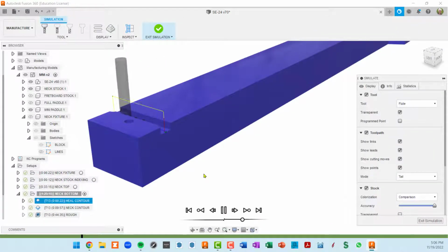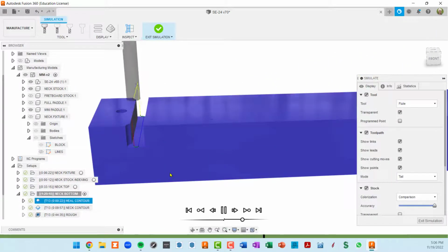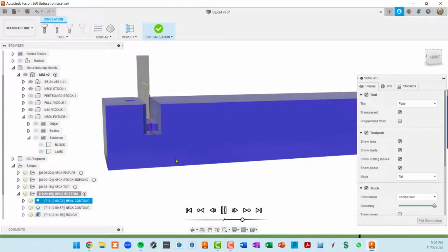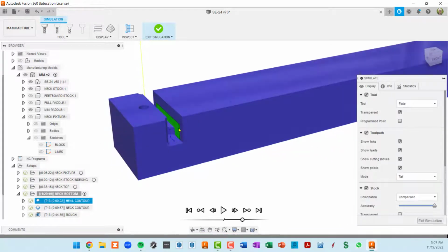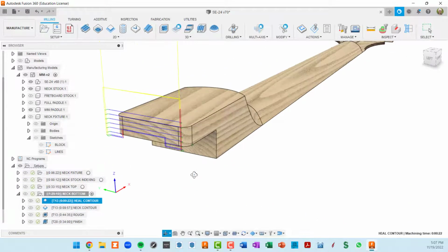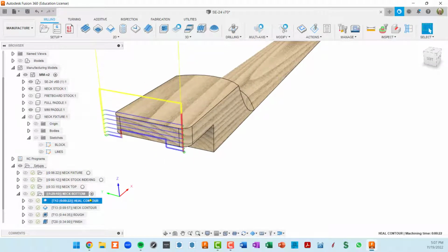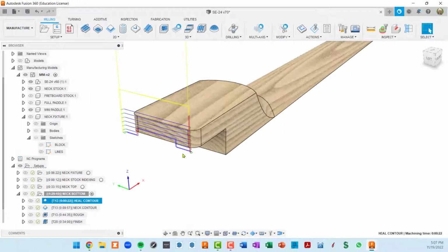and we will see that it will step over this tab pretty soon. There it is. And you see it's also getting extended way beyond the geometry of the neck, which is good. Okay. And in this case, you might see actually better information by just clicking here and seeing the toolpath. You can actually see where it steps up for the tab.